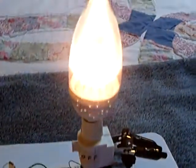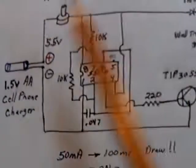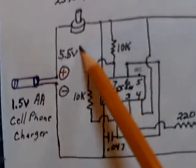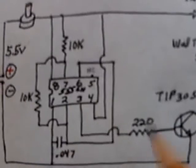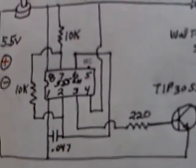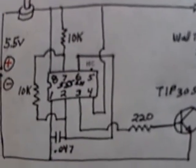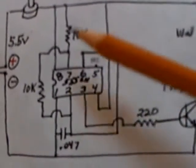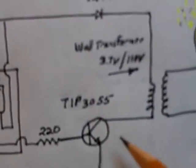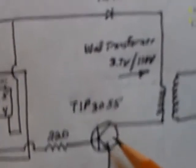I thought I would post this and show the circuit. It's a one-and-a-half volt cell phone charger — the double-A battery bumps the voltage to five-and-a-half — and it runs through that 555 timer chip. You can freeze-frame this and probably duplicate the circuit quite easily. It's a very simple 555 timer circuit with no potentiometers; I've got fixed resistors, going into a TIP3055.